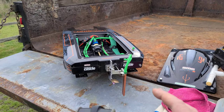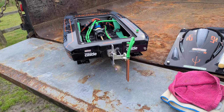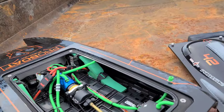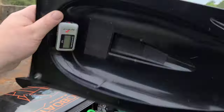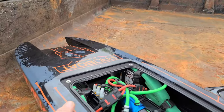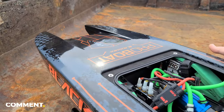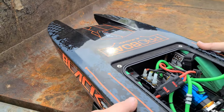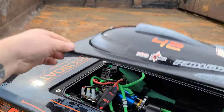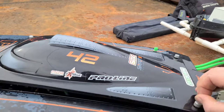So let's watch the rudder as we throttle it up. It's still doing it — not as bad, but it's still doing it. Everything's cleared out — four miles per hour on that one because I was moving it around. CG is just behind the forward step, about a quarter inch behind the forward step. Everything looks good — all greased up.